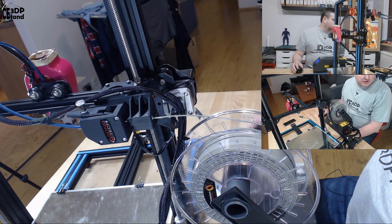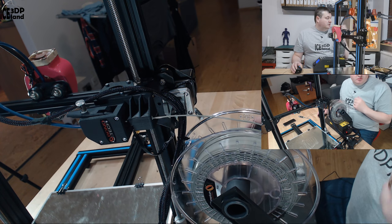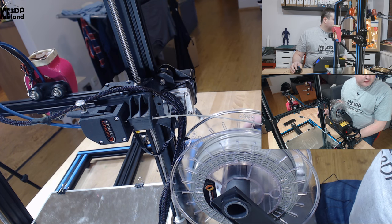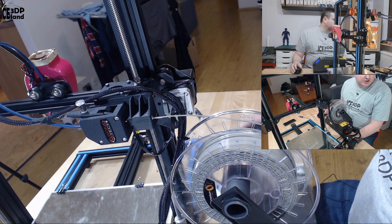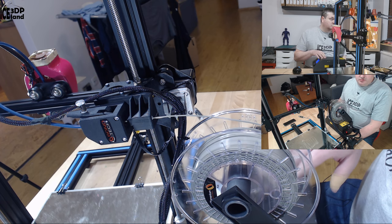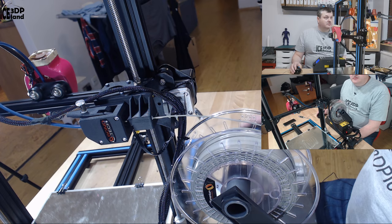I'm reading in the manual that you have to insert a new E-step value in the start G-code: M92 E415, because of the Bontech gears being a geared-down system so the motor has to move faster than it normally would. They also say you can update the firmware — the default steps per unit has to change from 96 to 415. I have to look at how to flash the CR10S printer; it has a bootloader so it should be flashable without problems, but I haven't edited a Marlin configuration file before.